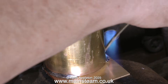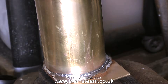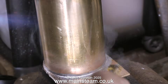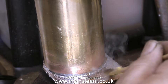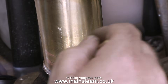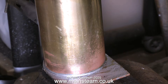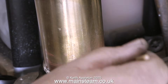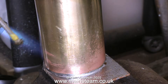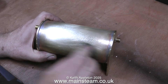When the assembly had cooled sufficiently, I turned it over and accurately positioned it on the other side plate, and here I'm soldering it in place. This time I do have video of the soldering process because it was much easier to film from the outside. In this clip I'm demonstrating the use of flux — as I brush the flux on the metal, the solder flows wherever the flux is. When making a soft soldered component like this, I clean up the solder by dipping the brush into some water and cleaning off all the burnt residue before letting it cool.